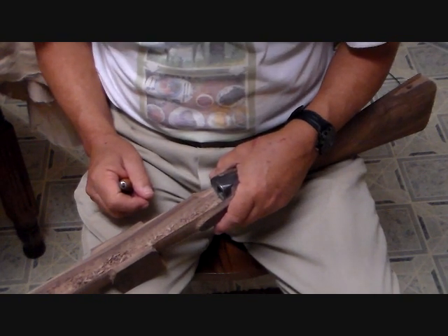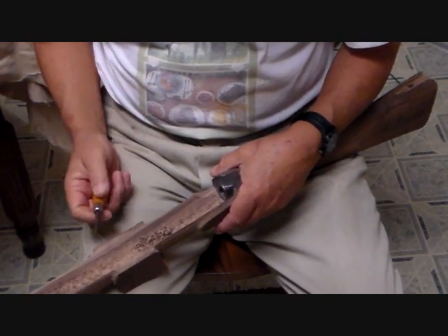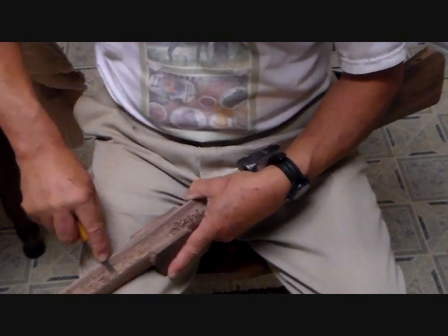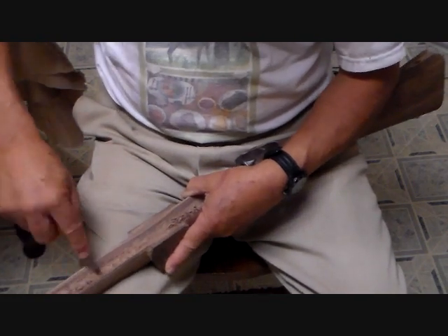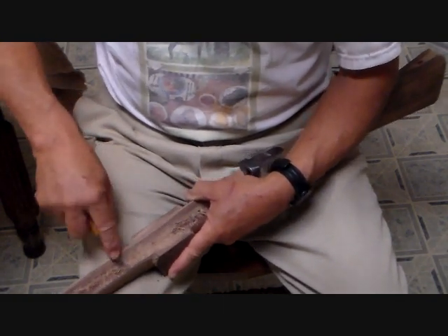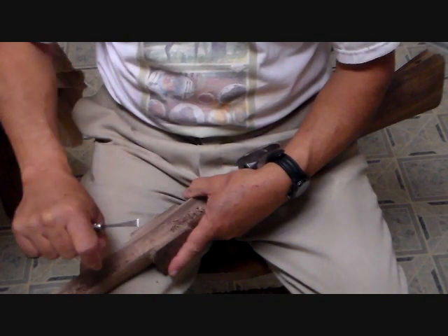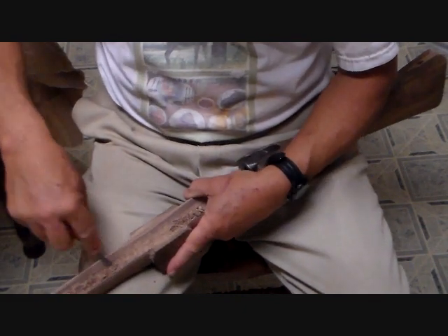On this video I really don't have the time to take you through every step, or this would be a series that would last for hours and hours. But just to show you how I'm inletting the blank — you take your carving tool like this, go inside, push, and that scrapes up the wood. There are many other tools that might be used, some mechanical and some hand tools. One of which is an inletting rasp, which is a dog-legged piece of metal — it goes like that — and then you have a cylindrical rasp that extends for about three or four inches. You take this and scrub it up and down the barrel channel. That's a nice tool if you happen to have one.